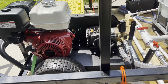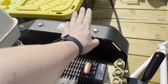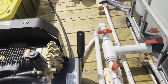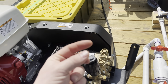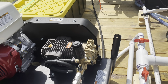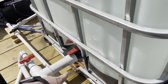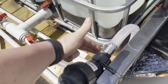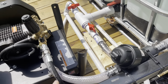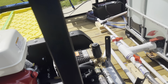This is a Comet pump Honda engine, 4000 PSI, mounted to the side — got that from Northern Tool. Most important thing: belt-driven. A belt-driven pump will pull water from this tank; if you have a direct drive, it will not — you'd need a secondary pump to push water. But with this amount of water pushing down into the inlet, the pressure washer will pull the water the rest of the way, and it works absolutely perfect.